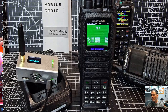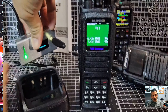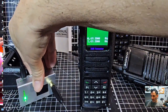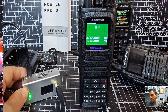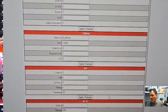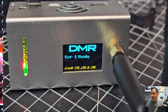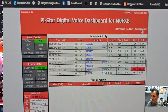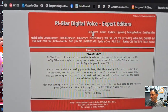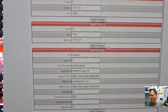That's me changing the orientation — if I turn it upside down, put the lead above, then go back into the PI Star settings into Configuration, scroll down until you see OLED, and turn the rotate to number one — change the zero to a one and apply the changes. It puts it the right way around and now you can have the power cable on top so it sits on the desk. Put a couple of rubber feet on that and you're good to go. From Expert, MMDVM Host, scroll down until you see the word OLED — that's how we flipped the screen.